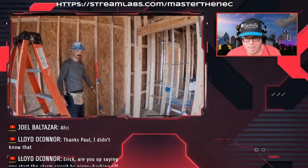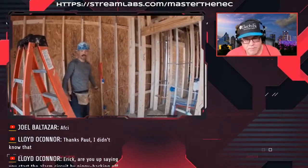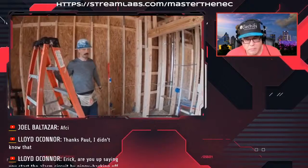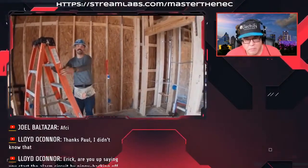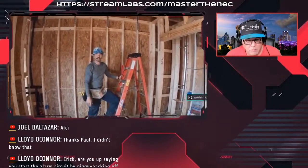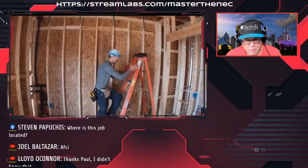Okay, just for clarity. Two power wires already in this receptacle. I'm just going to go ahead and add a third wire in there because I don't want to run through these TGIs. And I don't mind pigtailing some wires if it just saves me a little bit of time. I mean, obviously, with me talking right now, I could have already done it and ran it over there to that switch box, but... All right, so let's talk about that real quick since we're here.